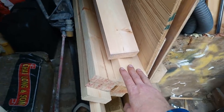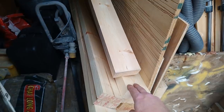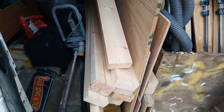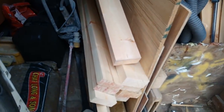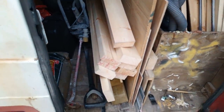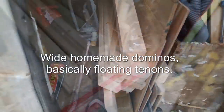And then the gates, they want them to be able to lock. So I'm going to make a frame door with matchboard. There's a load of matchboard up there. You've got to remember, I've got to make these as cheap as possible. So I'm going to domino the joints. I'm not going to fret around mortising and tenoning them.